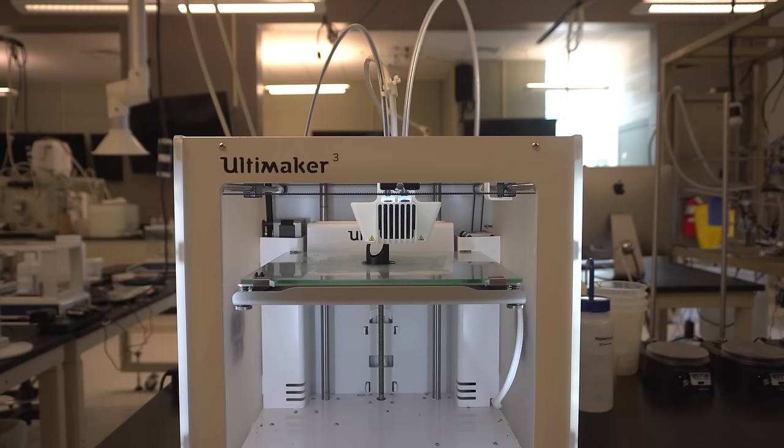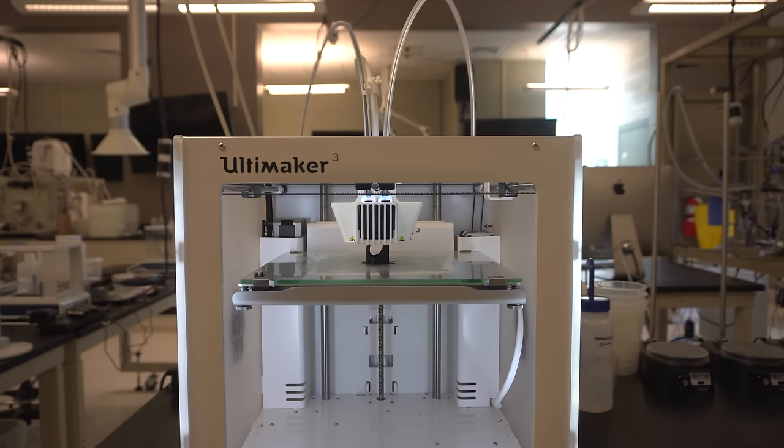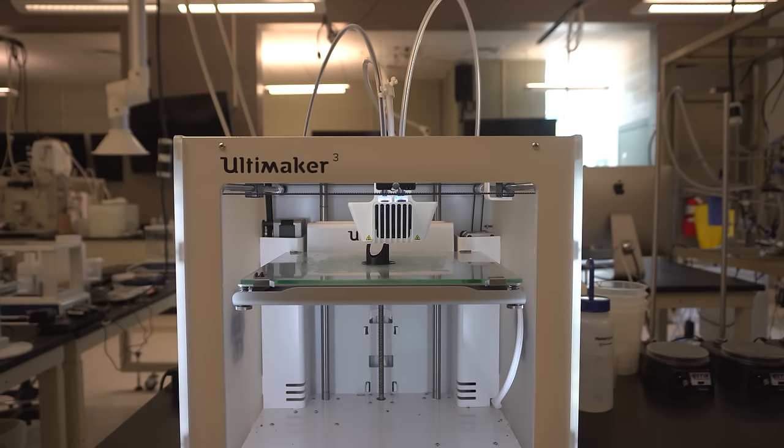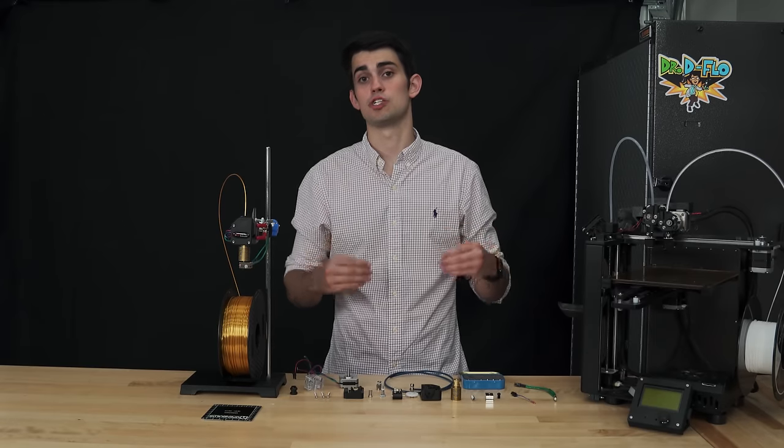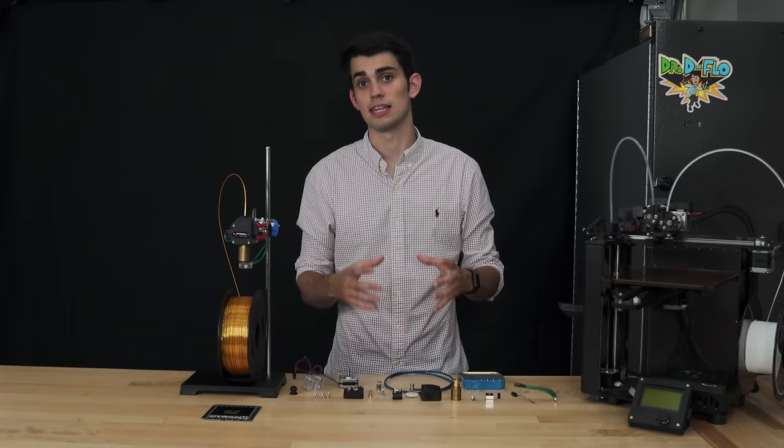With the Bowden tube extrusion drive system, the print head can accelerate and decelerate faster because the print carriage does not have the added weight of the motor. This can significantly speed up print times. The drawback for this setup is the distance between the extrusion drive and the hot end. This longer distance results in the extrusion process being less responsive.